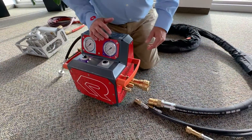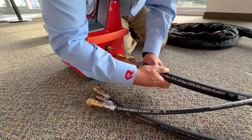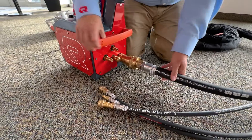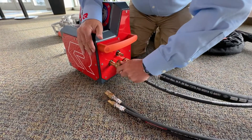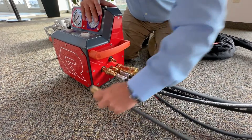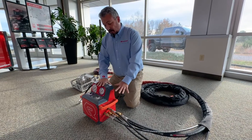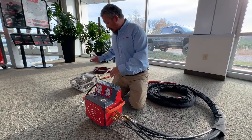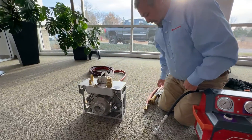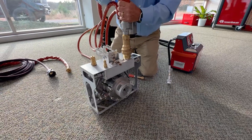When connecting, we have different connectors that go onto this unit. Always start by inserting into the main unit and making sure the collars snap back — we want positive connections when hooking things up. Each one needs to be placed in the socket and confirmed for a positive connection so nothing comes undone while operating. A quick check will save a lot of time later. One thing that makes connections easier is tilting the unit upward, which allows a positive downward force to achieve a positive connection.